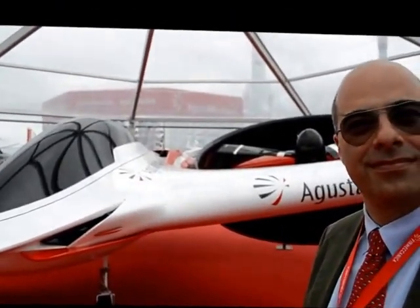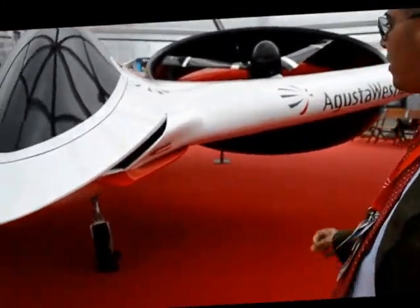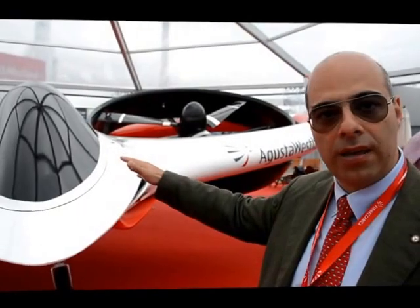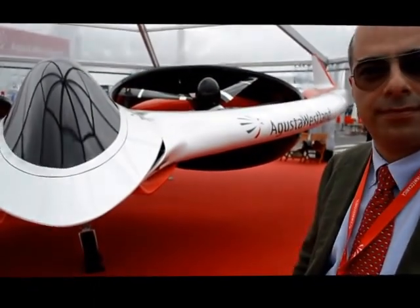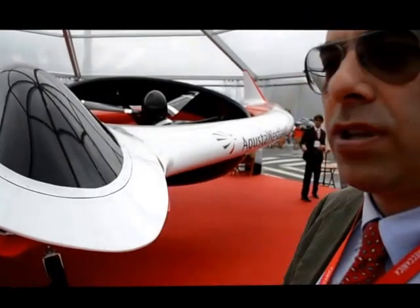What's the most significant factor of this technology demonstrator? Certainly the non-conventional architecture and quite definitely the use of electric motors for main propulsion, as well as electromechanical actuators for all the actuation of the aircraft — so we have no hydraulics on the aircraft at all. The blade pitch, which is controlled individually blade by blade, is done through electromechanical actuators, as well as the tilting of the nacelles and the retraction of the landing gear. The motors are made by a company in Italy called Lucca Electromechanica.